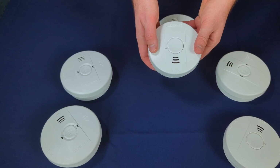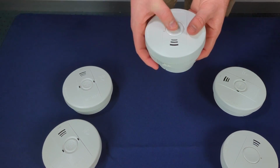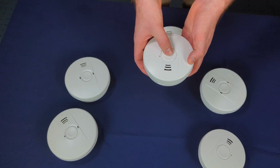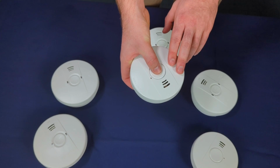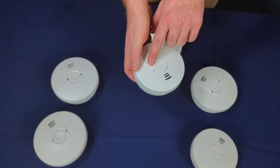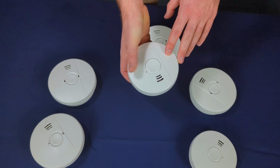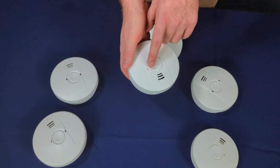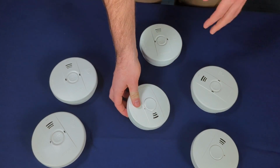And then once you've got a reset network, you can start from scratch. So we'll just do the setup from scratch one more time. Because the alarms have been reset, they're in a new status, so you need to turn them on for them to be in network mode. So I'm going to make this DCW the master and make sure it's in the most central location. We're going to double press the button. That'll turn the alarm on and it will start flashing on and off. That's searching mode. Double press it again, making the sonar ping, and it's flashing 2 times. That means the network is open and it is the master.